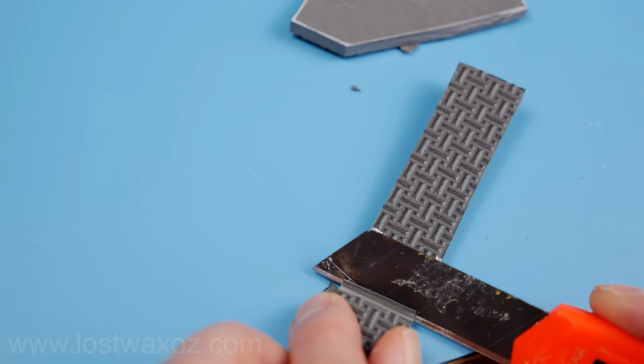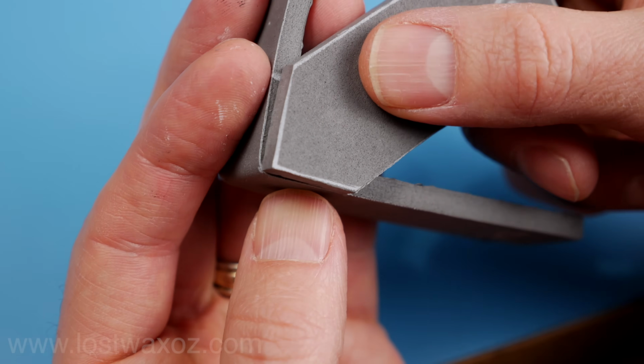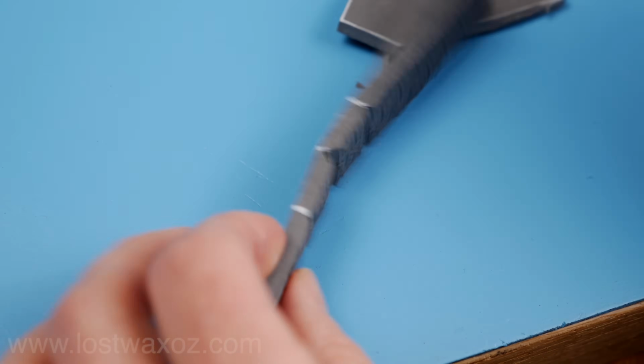Cut the middle V-groove in the trigger box center, piece 74, and make sure it matches the point of the trigger box side. Then you can cut the other 2 V-grooves as well.